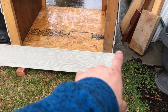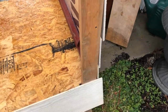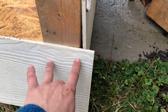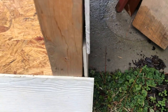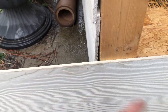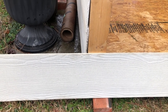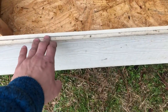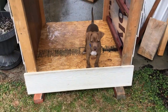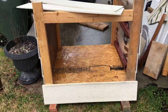Here I have set up this next piece. I figured instead of measuring and cutting and maybe messing up, since we do want to have a little bit of overlap over here so no extra wind or rain will go into there, I went ahead and just propped it up against it and I'm going to go ahead and mark it right here. That way it will be a lot easier to get the right size for it and then we can actually work with it. Let's go ahead and get this measured out and cut. Finally cut — here are two pieces right there, and there are two more the same exact length, cut over there with the saw. So we're going to go ahead and lean this over and start attaching this piece right here.